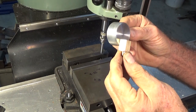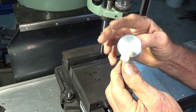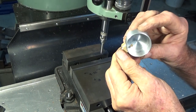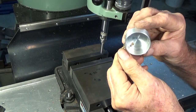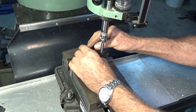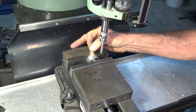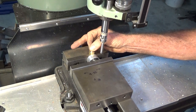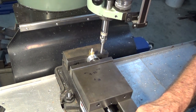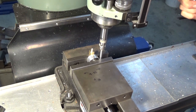I've assembled the little brass stem on the outside of this aluminium cup. It needs to go on the inside when finished, and I've just got a pair of screws there holding it in place for now. This is going to allow me to set this up in the mill vice so I can just drop that down and let the brass piece rest on the fixture, then do that up ever so gently so we don't crush anything. Then I've got one of these touch-point sensors and we're going to use that to find the centre of the part.